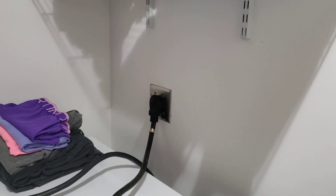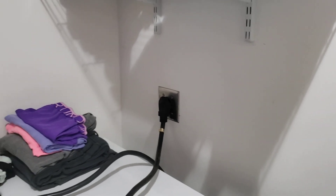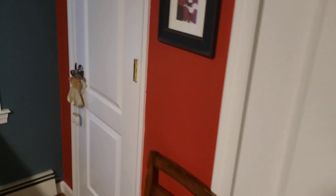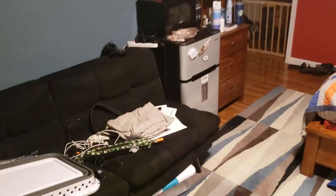Since it's a 50-amp breaker, you pretty much back-feed the entire house. But you have to make sure before you do anything else, you do one major thing: you take the main breaker and turn it off. Now this is not 100% legal, to be honest, so you do it at your own responsibility. As long as you turn the main breaker off you're good, but if you forget that, you might actually kill somebody.